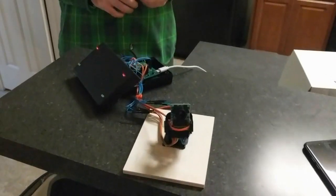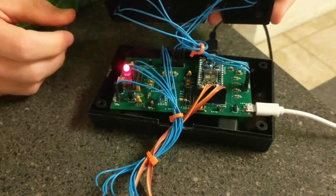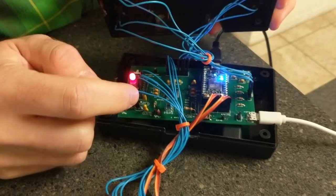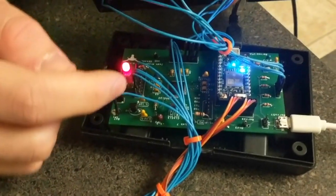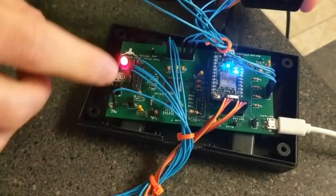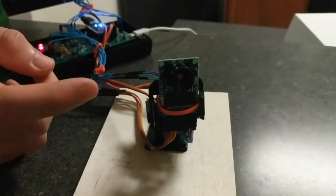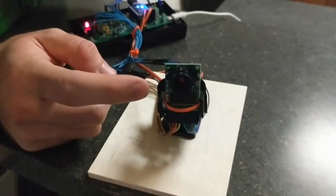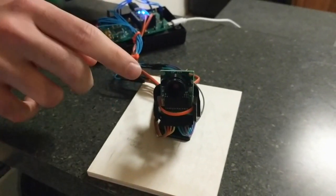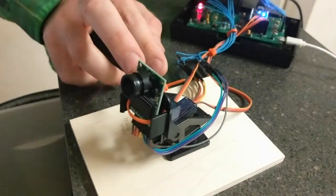We're here to show you our 445L embedded systems final project. We created a face tracking camera that we configured here. So here's our PCB. We have a TM4C microcontroller. The microcontroller has a bunch of pins running out onto our logic analyzer pins. And these run out to the camera over here, an ArduCam 2 megapixel camera, and then we have a gimbal consisting of two servos that we're controlling with PWM signals.